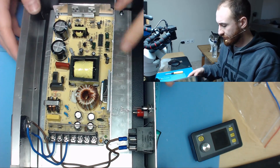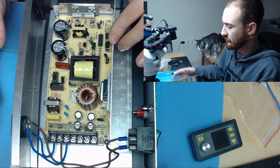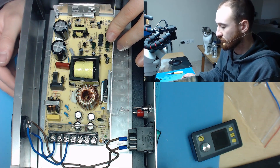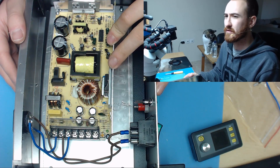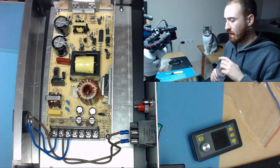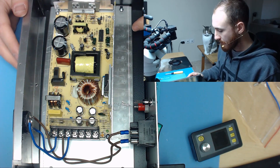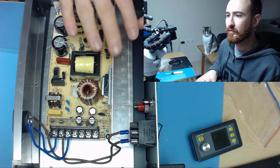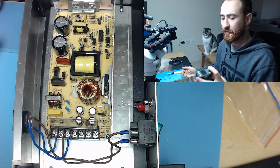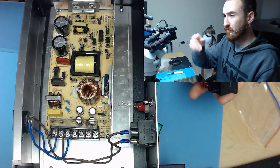So what I have done so far — I will use an LED power supply that will transform the 220 volts from the wall plug to 24 volts DC. This power supply like this costs around 15 bucks or maybe less. Basically we are gonna take the 24 volts DC output from the main power supply, give it to this module and it will regulate it. And we can control it electronically from here or from the computer software.